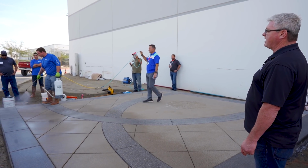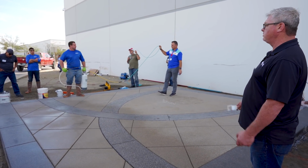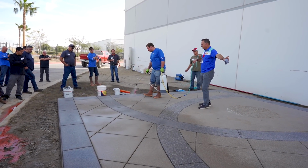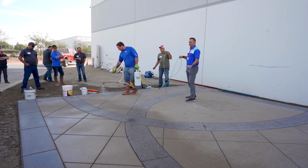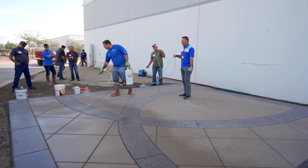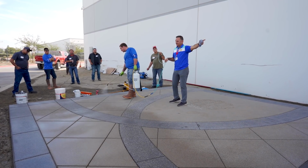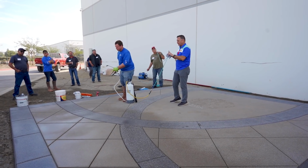So we're gonna do a little bit with that tip. He's got a conical tip here also, that's what we would normally use with something like this. We use an acetone resistant sprayer for the acetone based spray or sealer. Here, this is your straight solvent, a xylene based material, good for a second coat. So we use this sealer. You could also use that same spray can for this one, but you can't use vice versa.